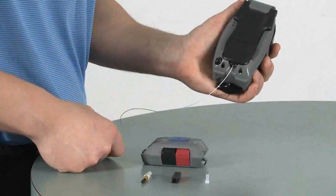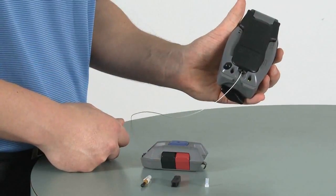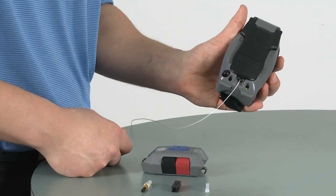When the green light illuminates, indicating a successful termination, turn the crimp knob 180 degrees. Clockwise or counterclockwise doesn't matter. Slight resistance while turning the knob is normal. By turning the crimp knob, we have crimped the lead-in tube, and this is what holds the fiber in place.